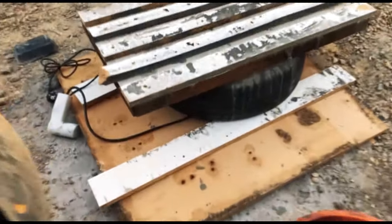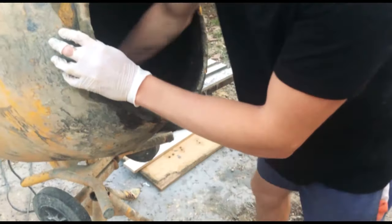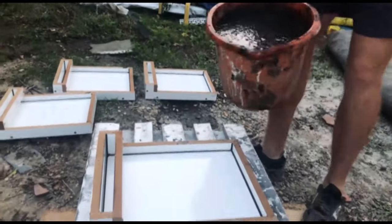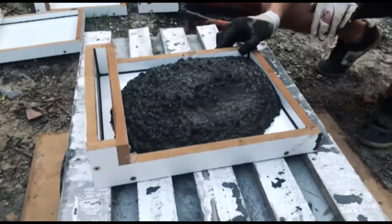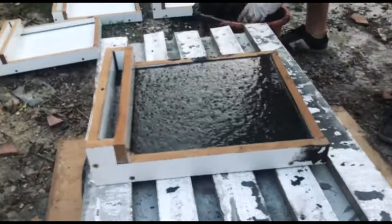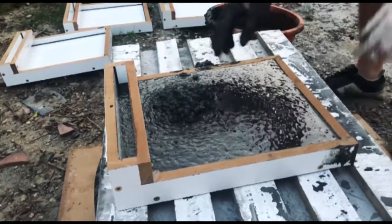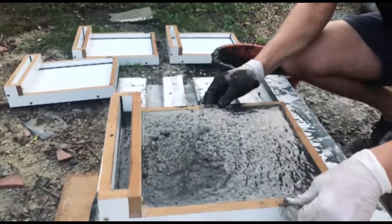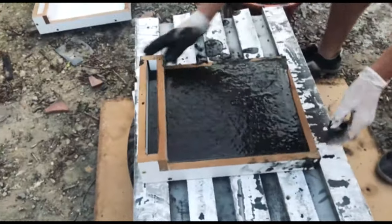What you can see here is a vibrating table made from an old car tire, a piece of old melamine board, and a vibrating motor mounted on the underside. This is a really good way to make a cost-effective vibrating table without spending thousands on a professional welded metal one. It works really well — all the bubbles vibrate to the top and you get a really consistent piece of concrete. The motor was around 40 to 50 pounds sourced from Czech Republic; I've put a link in the description. It's a great solution for DIY projects if you're not planning to do this professionally.